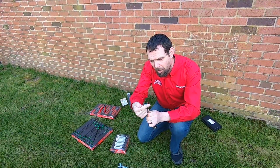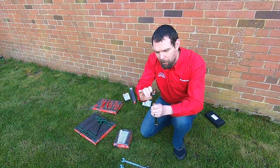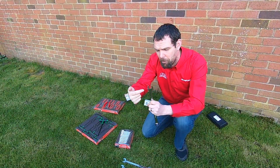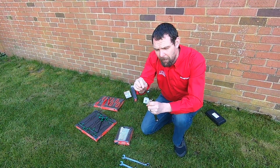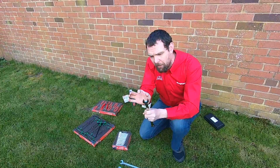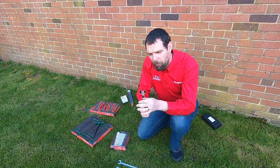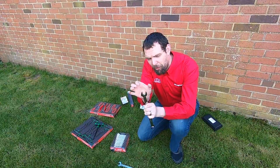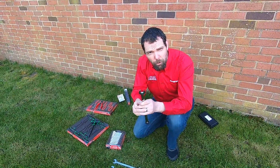This continuous arc design here will give you a perfect circle. So if I was to lay the wrench on a piece of paper and draw around that curve, the total curve would be a circle, and that means that load across the jaws when under load goes down the shank, so you get little spread of them coming apart. And with the cheaper ones, when you load them, the jaws will actually flick apart for a fraction of a second, and that will mean that you round that fastener off and struggle to remove it.